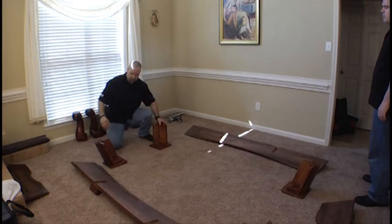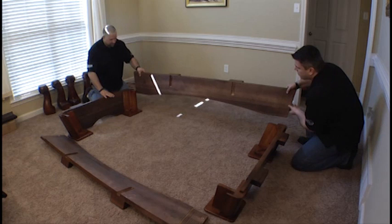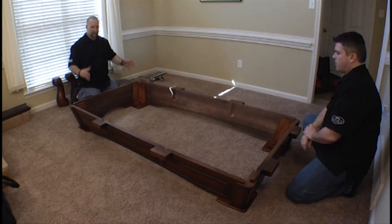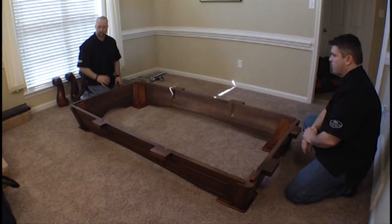We're going to set our panels in, quite simply, all the way down. We'll take the long panel and slide it in as well. They slide down very easily. Just make sure everything is squeezed together, and that gives us the shape of the tapered cabinet and that gives us the corner. If everything is resting on the plate and everything is tight to the corner, we'll just insert our bolts and tighten them, and the basic shape and structure will be done.